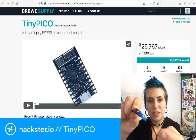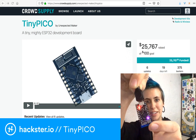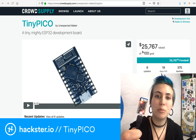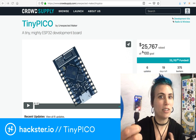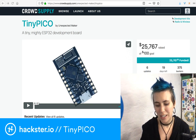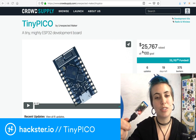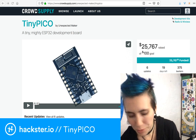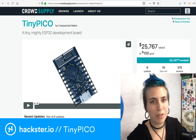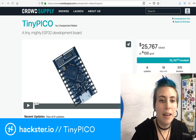It also comes with a 3D printed little thingamajig to stabilize the Wi-Fi antenna on here, because it's an ESP32, it has Wi-Fi, and it has an onboard APA102, aka DotStar LED, if you follow the Adafruit terminology, and the whole thing is pre-programmed with this code to sort of cycle it through a rainbow pattern, which is really nice. I love demo code, yes! The pre-production version came with demo code too, but it just sort of flashed different colors.